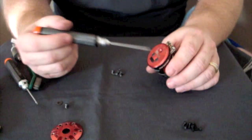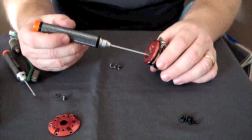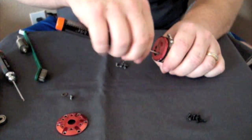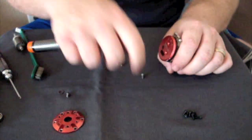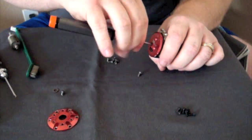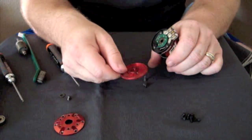The next step is to take off the rear end bell plate. You're going to take three screws off — these are 5/64ths or 2mm, it doesn't matter which. These also need to be checked; if they're stripped, now's the time to replace them. A stripped screw you'll always get out the one time, but if you put it back in, you'll never get it out again. So take off the rear end bell plate and check for dirt.